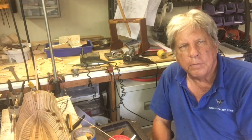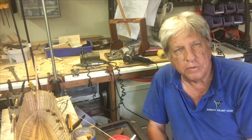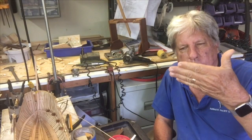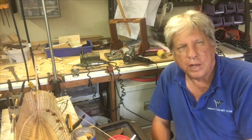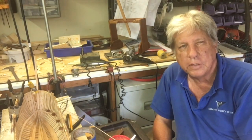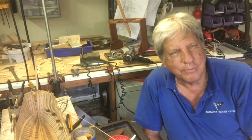The only comment I can make is the one thing we did not do is this strake 15 was supposed to be 5 inches thick with what he calls a let down from the top of the strake to the bottom of the strake from 5 to 4 inches. I tried to do that and found it very difficult to do over the length of the piece. So I've installed it at 4 inches, and I'll pay the criticism for doing that.